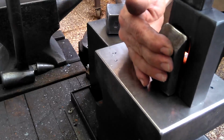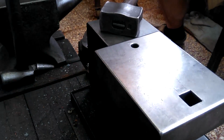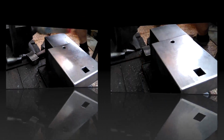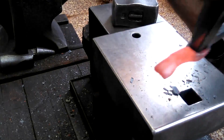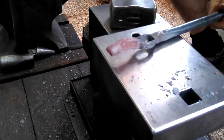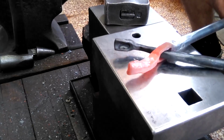Here I'm just doing the normal treatment that I do for the handle end. Like I said, I just wanted to finish this out and follow through on what I started. A steeper tapered punch here to widen this out so it'll accept the other half. The other half will be able to pass through. Now I'm putting the two halves permanently together on this adjustable rivet-less tong.